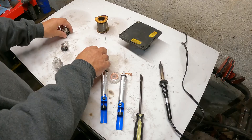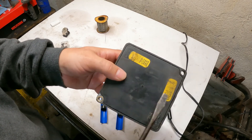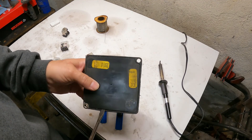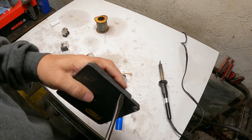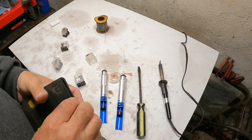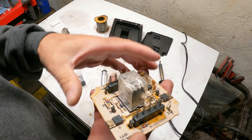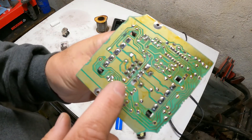All you've got to do is take a screwdriver. Once you get your module off — there's just two 10-millimeter headed bolts that hold it on — yes, it will say 'replace, do not repair' on the stickers on the back. That's one of those things you've got to determine if you want to pay attention to or not. If your headlight doors are binding up or something like that, you're just going to keep burning up these modules, so take care of that problem first. Here's the new one soldered in — here's my really bad soldering job.